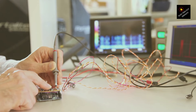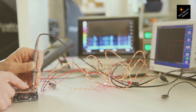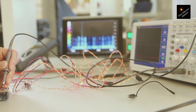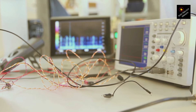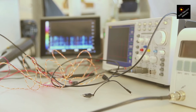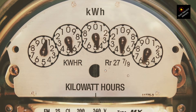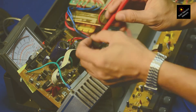So what's the solution? Check if your appliance is frequency-specific or if it's designed to handle both 50 hertz and 60 hertz. Many modern electronics are designed to work with both, making them global troopers. For those appliances that can't automatically adjust, you'll need a frequency converter — kind of like a translator that helps your appliance understand the local electric tempo. These devices can be pricey and are usually justified for more expensive equipment or where no alternative appliance is available. Check the video description — you'll find my recommended high-rated converter. Remember, a travel adapter will make sure your plug fits, but it won't change the frequency. For that, you need the right converter that matches your appliance's power requirements.